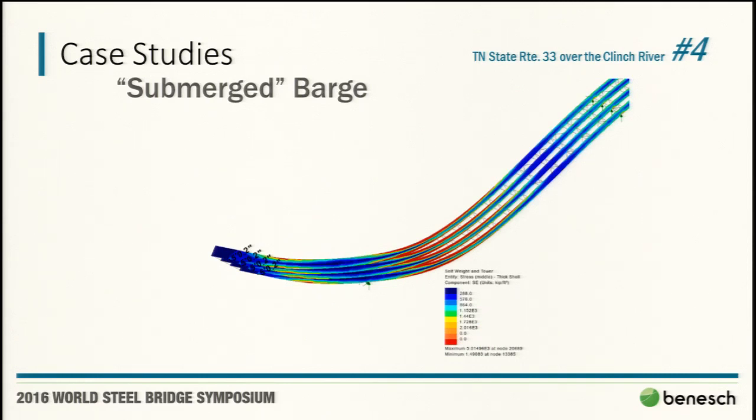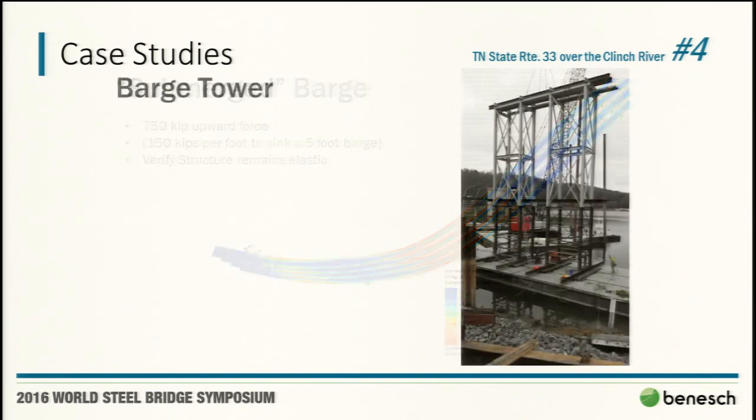The key here was the pier stayed engaged. We didn't want to lose the pier because obviously a flash flood effect, you're also looking at heavy stream flows. So if you lose the pier and you got this, bad. We held the pier, which was good. Did not buckle in compression in the adjacent span. So we were happy about that.